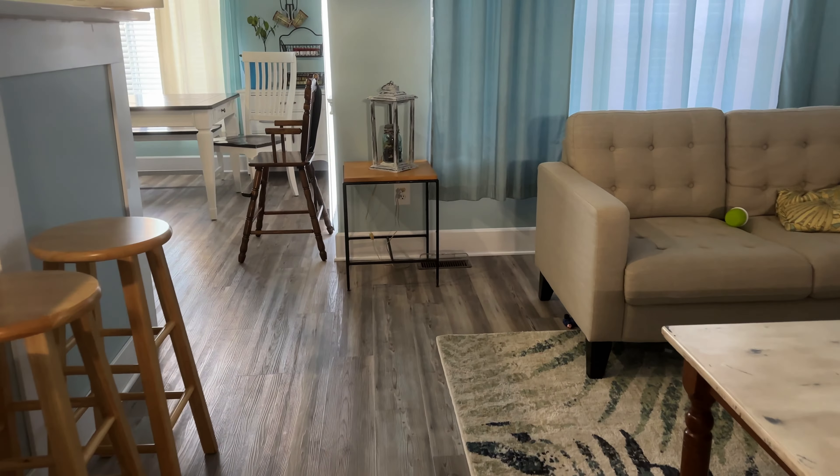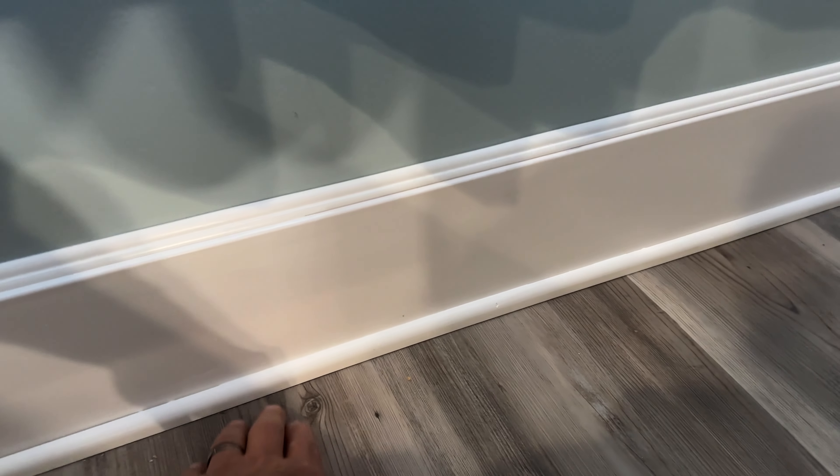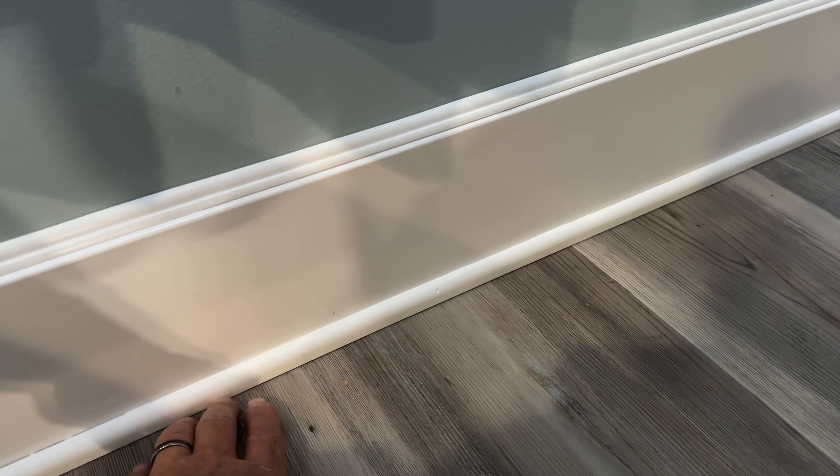One of the biggest jobs was all the baseboards. We started out with five-and-a-quarter-inch baseboard — right there, five-and-a-quarter-inch. We thought this was going to look really cool. But because of the flooring, there were gaps under here, so we had to put three-quarter-inch round to cover the gaps where the floor wasn't level. And then the wall wasn't level either, so you could see gaps, and I had to add trim at the top. That made it complete and look good — it was just three times more work.